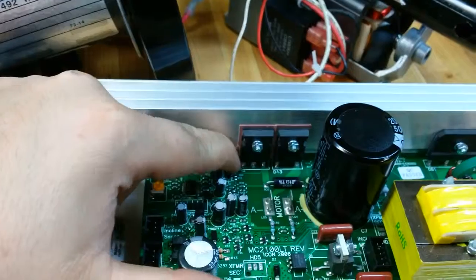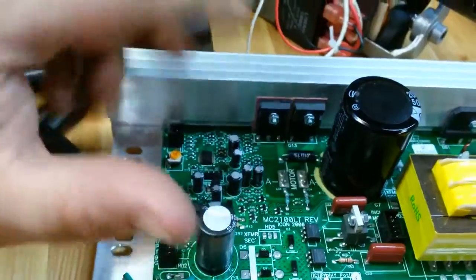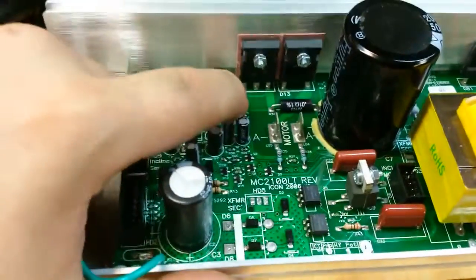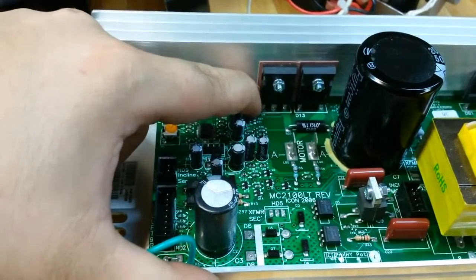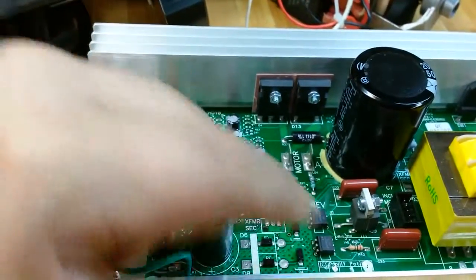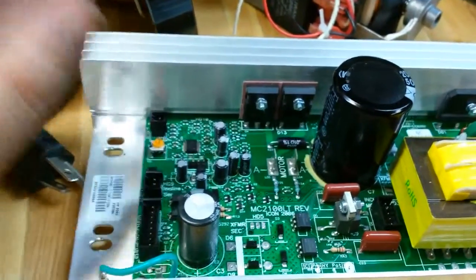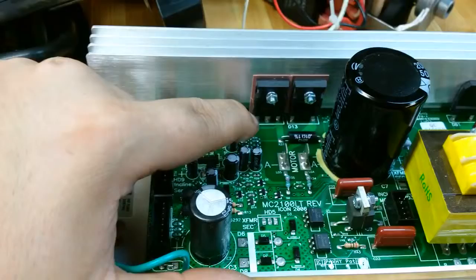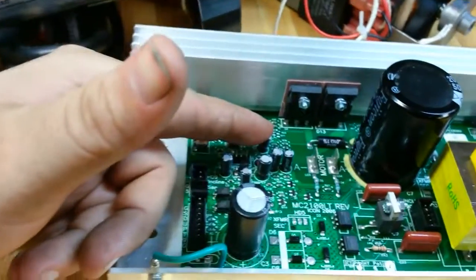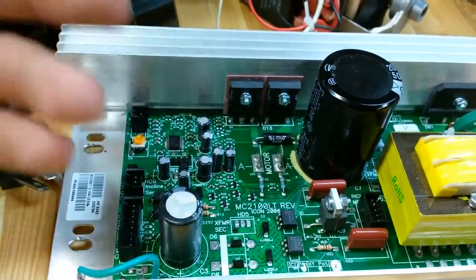And then that right there is our gate. This is what switches this on and off, and that'll be controlled through here through some pulse width modulation magic, whatever it does. We're not going to use that. If you just want to give it direct power, you can plug 5 volts directly to this rail. Of course, cut it off of the board because otherwise it'll interfere with these other circuit boards and cause switches to turn on and off because you're backfeeding power. Not good. So always clip that off and solder a point directly to it. Again, you can just provide it 5 volts live, or you can get an Arduino and provide pulse width modulation, which would then give you speed control.